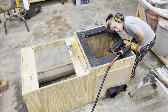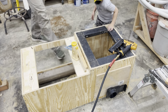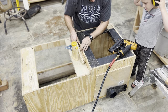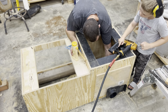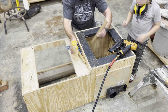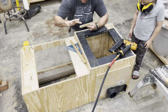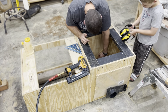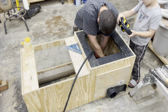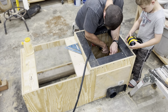There are a few things that let him do that are a little questionable for a six-year-old, but look at this kid — he's clearly a genius, so teaching him how to use this nail gun is one of those things. What I'm trying to do here is put in some sort of improvement for the dust collection. I don't want the dust in the table saw to just fall straight down to the bottom, so I'm creating some slants inside that box underneath the table saw — a V shape — so as the dust falls, it's collected as best as possible to the very bottom. Again, this is just scrap wood. I glue it in and put a few nails in, and that seems to hold it pretty good. Tight spot, little person — he can get in there and get it taken care of, so great learning lesson for him too.